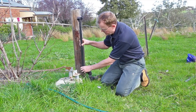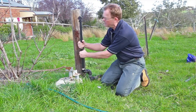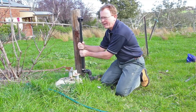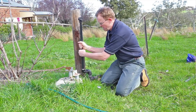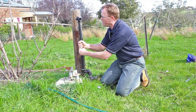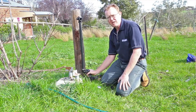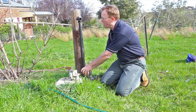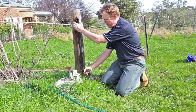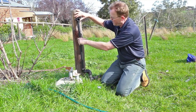So we'll just get that fitting started there. Again, plastic fittings generally will take up really well, so we don't need to apply bucket loads of tape. I can feel that's tightening up really, really nicely — quite tight there. We get it around to a position here. Because I haven't gone in a backwards direction, I can just move that over towards the post like that. Perfect — there we go.